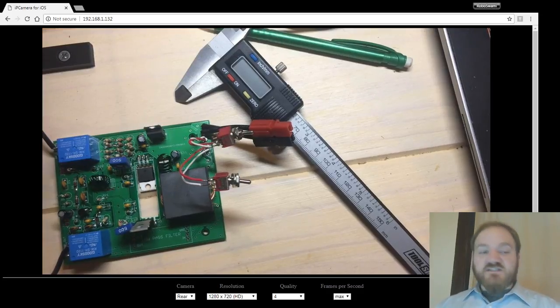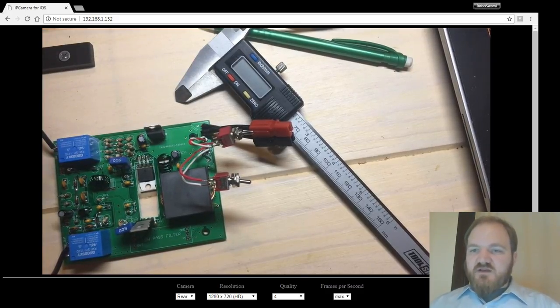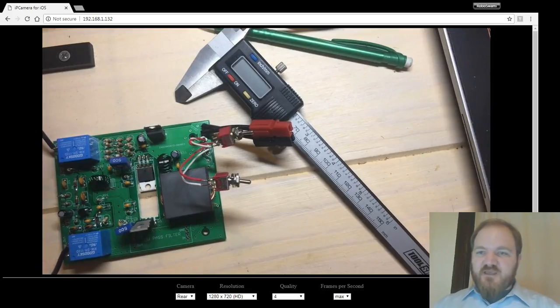On interior space. So we'll make these actual walls 30 millimeters tall. Oops, select that profile. We'll do 30 millimeters. Oops. No, not 30 PCB to bottom, 30 millimeters. And I suspect this is not going the way I want it to, so we'll actually tell it to go minus 30 millimeters, and we'll do a join, and there we are.